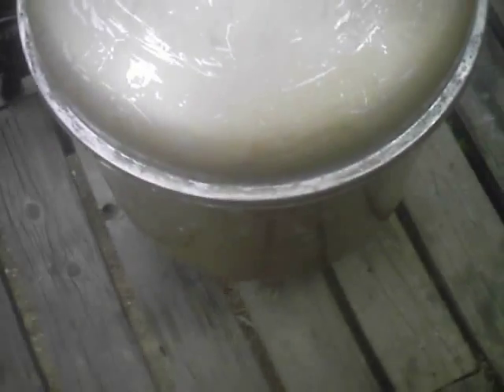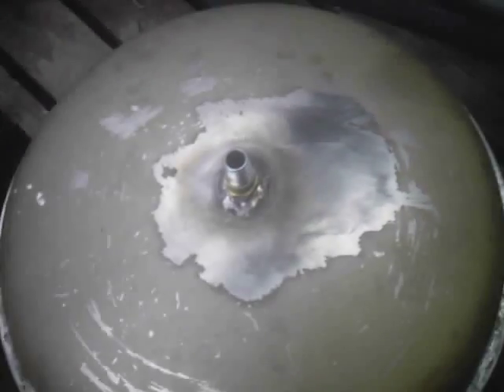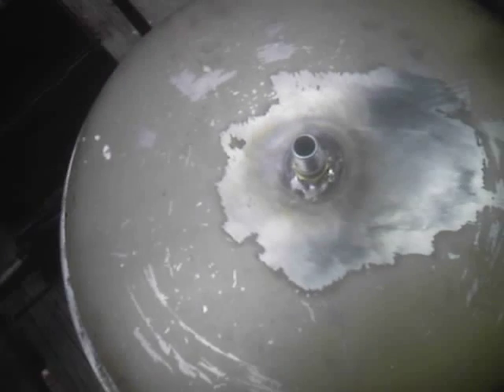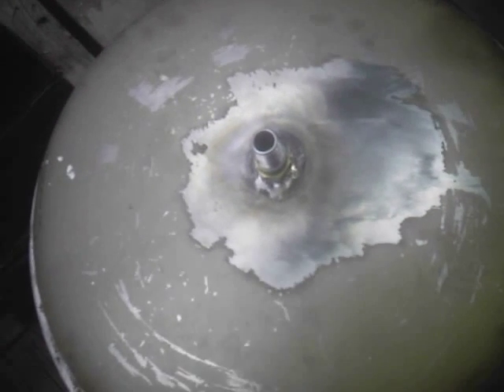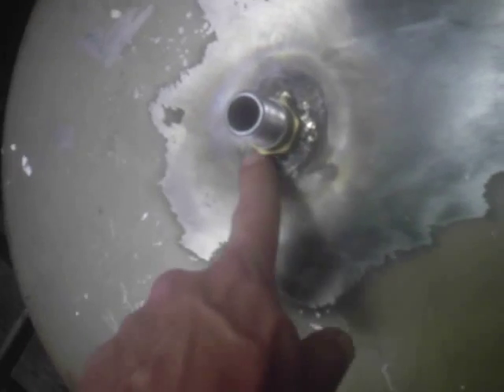Okay, tubers, here's our experimental cyclone slash bed filter. This is that Purex filter you saw before, and we took the other filters out. It's upside down right now, so this is a condensate drain that I brazed into the top of this thing, so that I can put my jar on there.